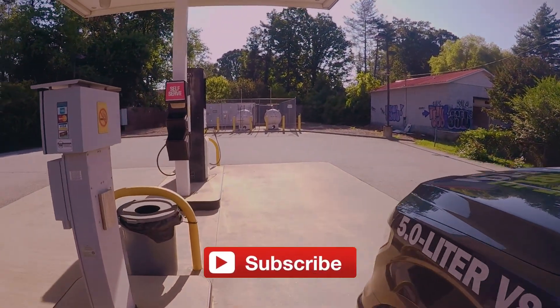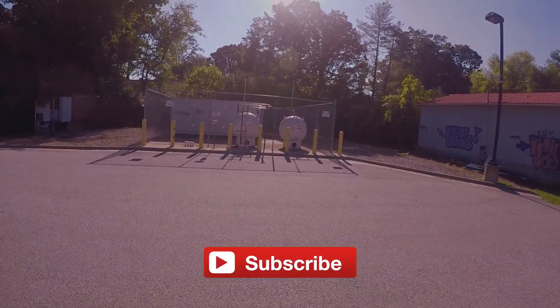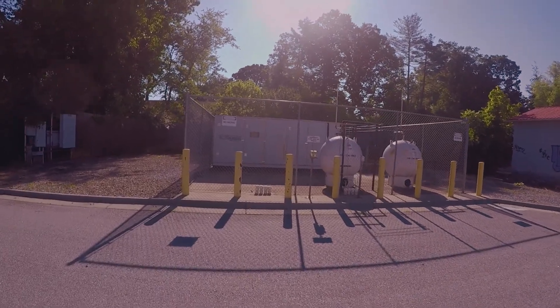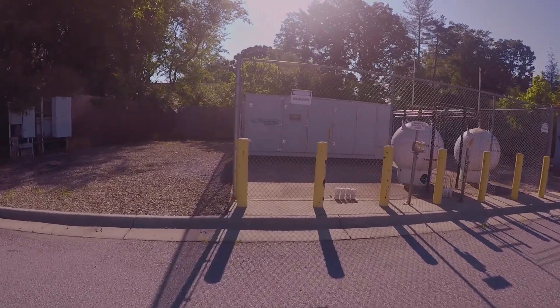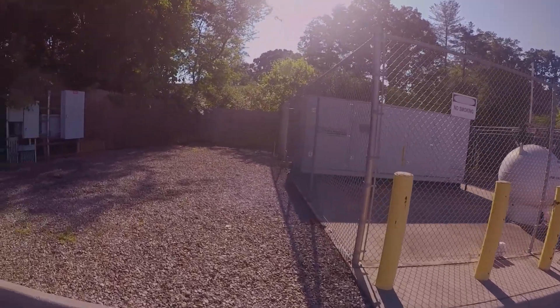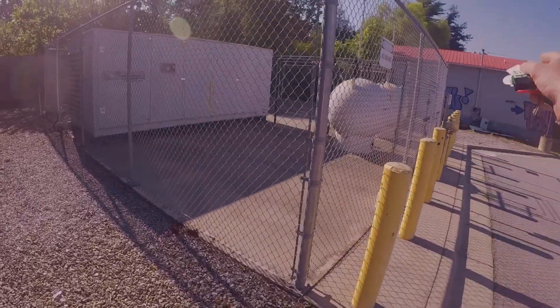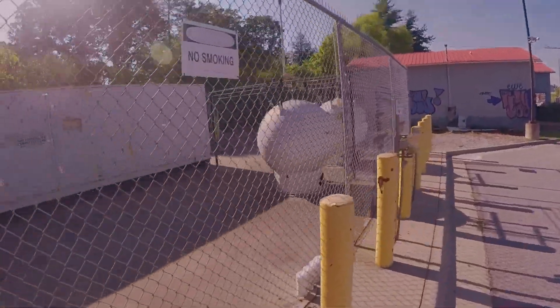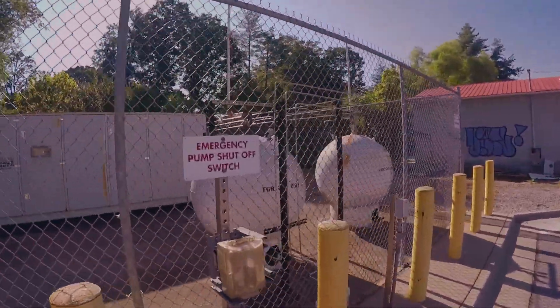That's happening. I'm gonna walk down over here. Let's go to the compressor. Stage one, stage two. Stage three is the compressor. If you guys know anything about a CNG station, typically how it works — it goes through stage one, whatever's in that sphere. Usually around 5,000 PSI.